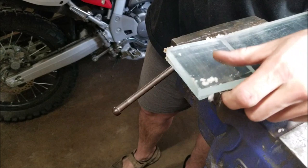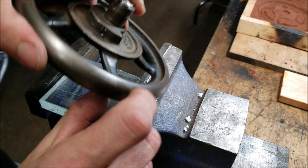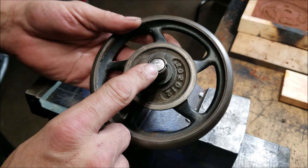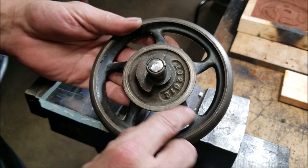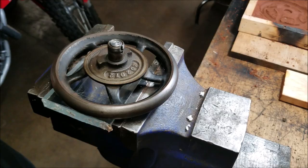Kind of new to doing casting work on this hand wheel. These spokes here are pretty narrow. Now this outside looks like it was machined. You know, the thought is to pour it from the center, but I have to have the brass flow through these and fill that. A little concerning, you know. I don't know how it was originally cast. I don't know if I'd go on the outside or what.